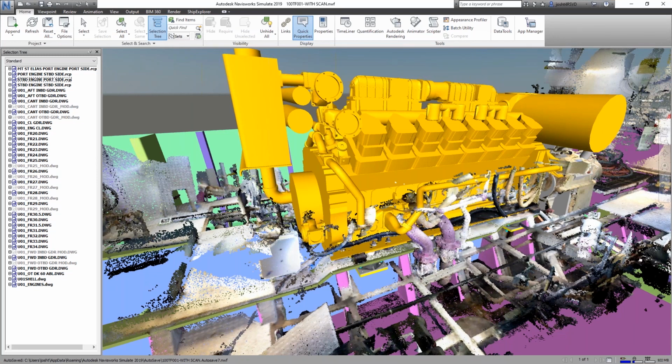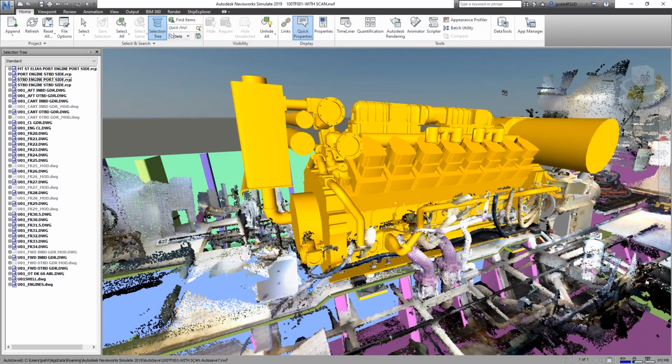So we've got some plans to do a few more of these. Each one's a little bit different. So the modification is going to be different, but the process is kind of similar. Get some as-built 3D data of what's out there in the vessel. Make sure that we know what we're dealing with so that we can really eliminate any of the unknowns when you get into being in the shipyard, actually cutting the parts out. We don't want to get into any surprises that could be costly and delay schedule.